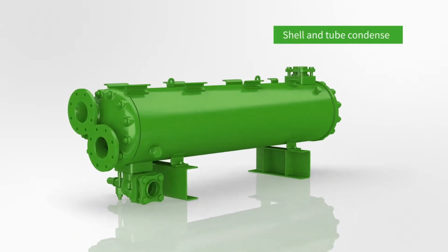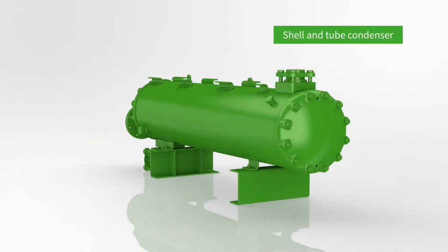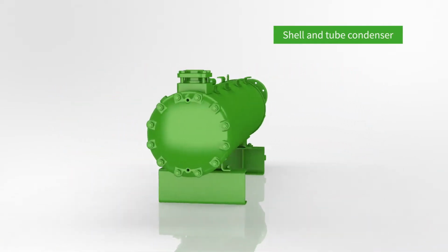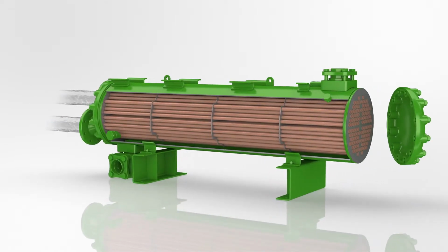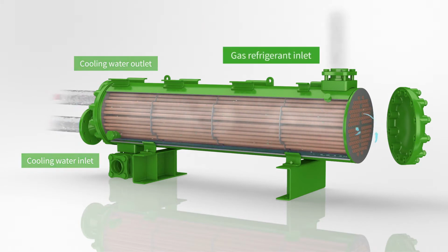Then, the hot furnace exhaust passes through a water-cooled condenser. As the exhaust cools, the mercury, which has a boiling point of 357 Celsius, is the first to condense into liquid, leaving the other gases and vapors to be vented or to be processed further to reduce air pollution.